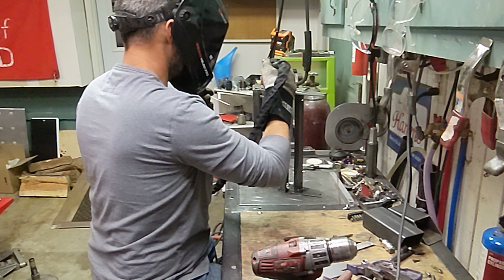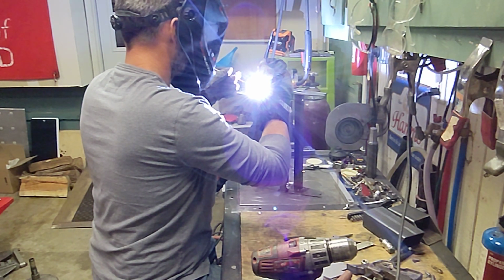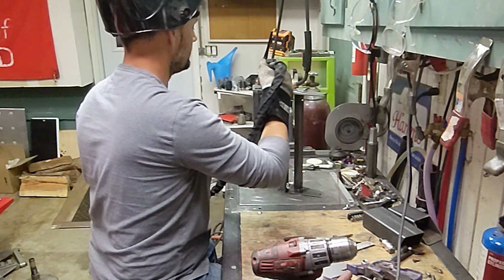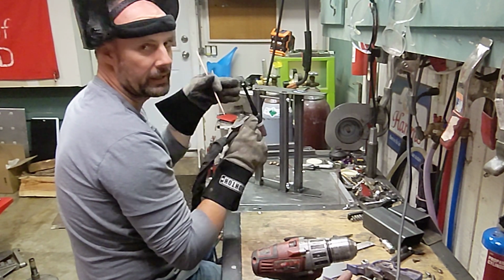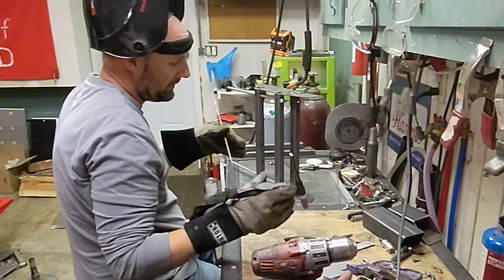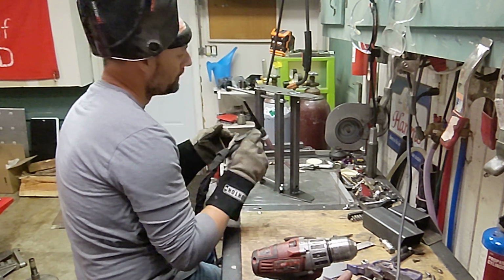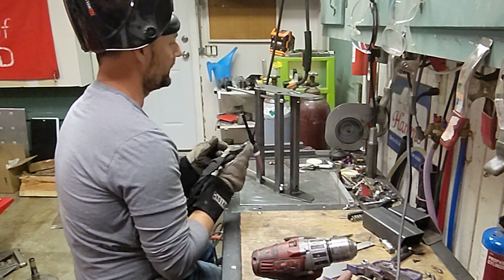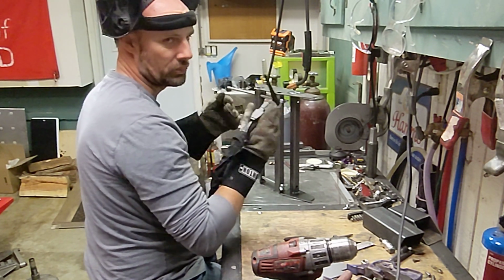That's not going to be the only material that supports everything. It's really just there because it is somewhat structural, but is enough material that I can weld to it easily. Once this gets done, I'll put the full left and right side together, slide that whole thing into the car and tack it together with a plate. Once it's in the car, some extra tubes and reinforcement will attach the frame to these mount points. But for now, these are just to hold everything together and be stiff and structural enough that nothing will warp as I finish welding everything out.